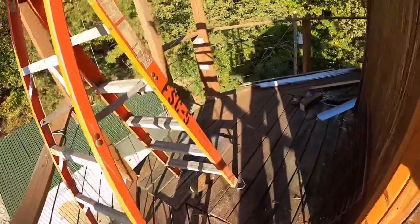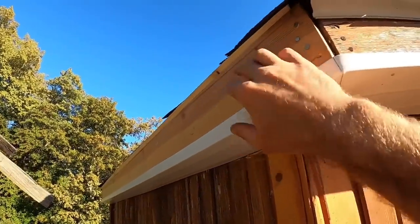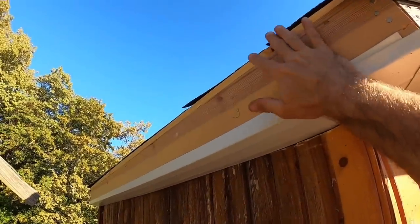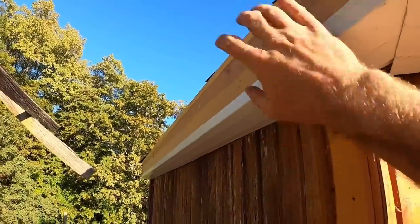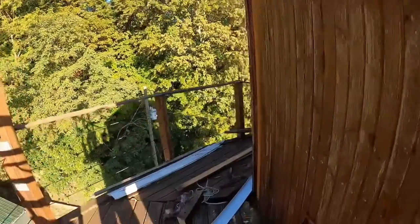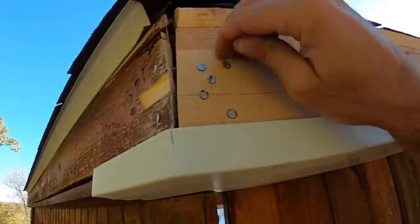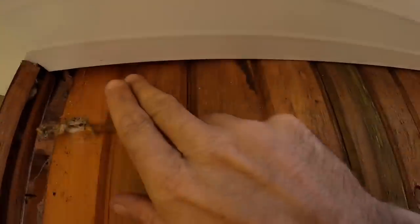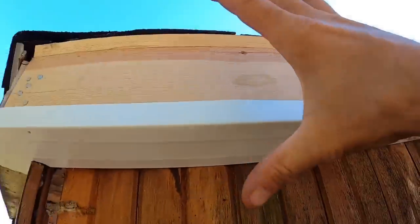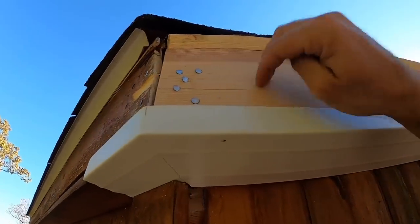I didn't video this part because it's a pretty dangerous part, but we built this box. We were short up on top. Yes, I still have to put drip edge on it and bring that around and put one row of shingles. But we built the box, boxed it in all the way over to this side over here and got it tied in. So this is nailed to this, and this is nailed to a bottom piece. And then I put a board all the way along this wall to nail it to. So everything is tied together as a true box.